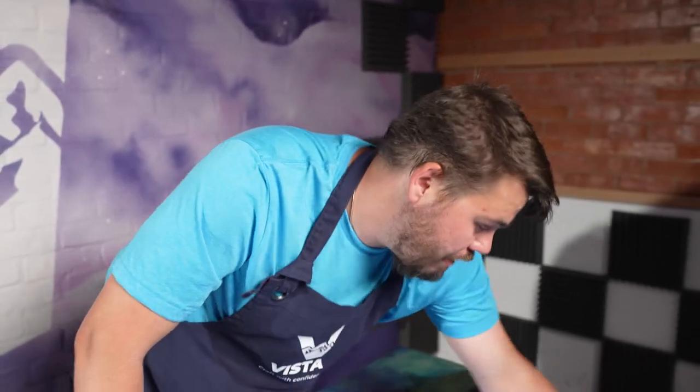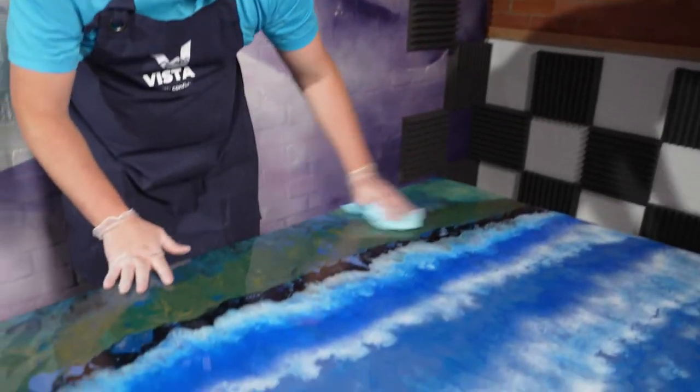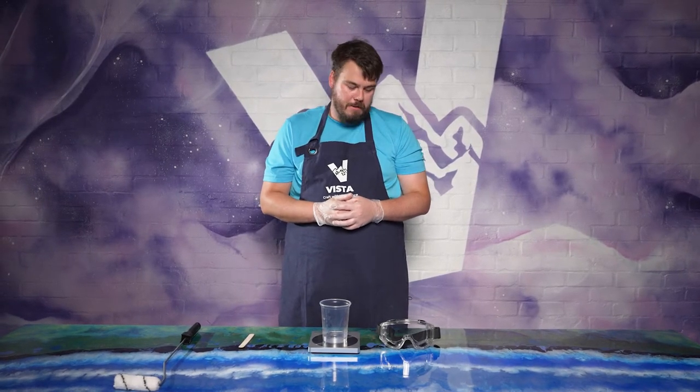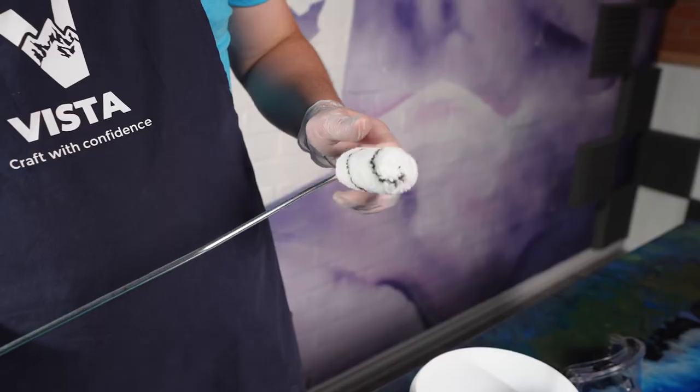Now that our table has been wiped down with a damp cloth, we're just going to dry it off with a dry cloth. We need to make sure that there's no dampness left in the table before we apply the Duraceal. Now that we've got our table prepared, we need to prepare to mix the Duraceal. Duraceal is a water-based product, but anytime you are using any resin product you need to make sure you're in a well-ventilated room and you've got the correct PPE — we've got eye protection and we've got gloves on.